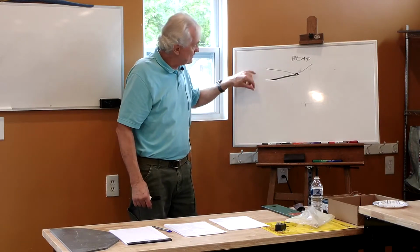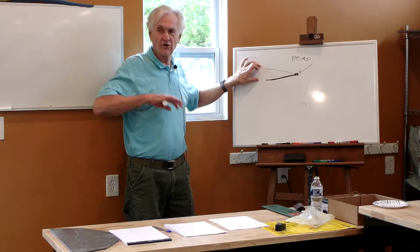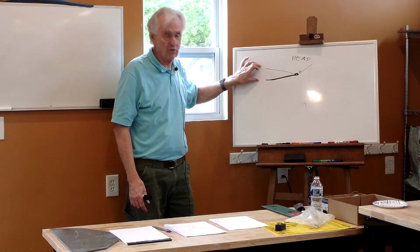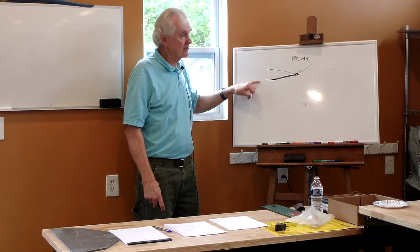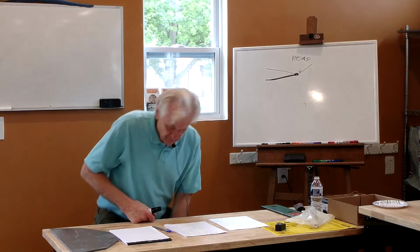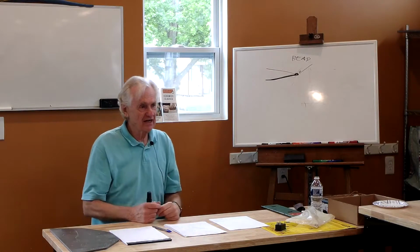And depending on what these wires are made out of, you get different amounts of current. So there's a whole different set of tables, depending on what the pairs of wires are, that correlates to temperature. But you're measuring current, and that current represents a certain temperature. Which was a great discovery. I mean, it's bizarre though. You just connect two metals, heat them up, and you get an electric current out of it.